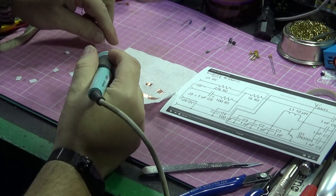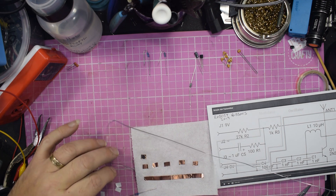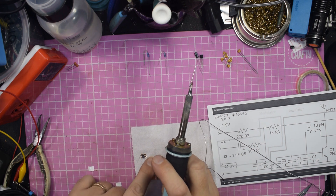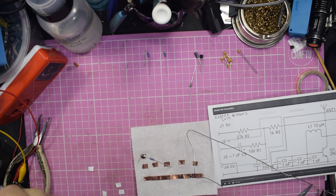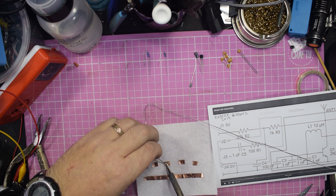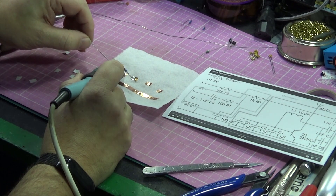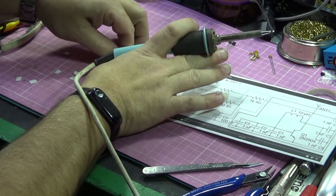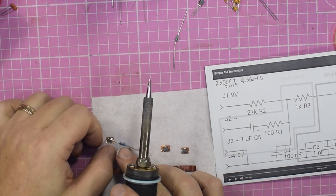I've got a brand new tip on the soldering iron. I'm going to just put a blob of solder on the foil to start, and a blob just on the component to tin the lead. Now if you like your fingers you won't do that, because that gets slightly warm, I think is the phrase I could use. So we'll solder that one to there like that, and while we're here at this end of the board I'm going to put a blob of solder on each of these, and turn that upright so we've got our clip lead facing upwards.